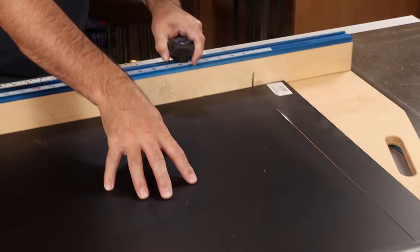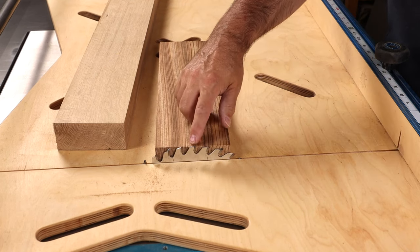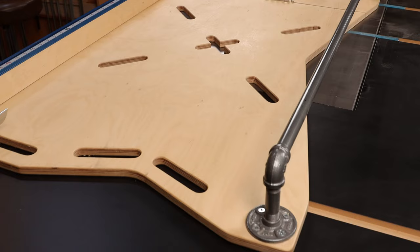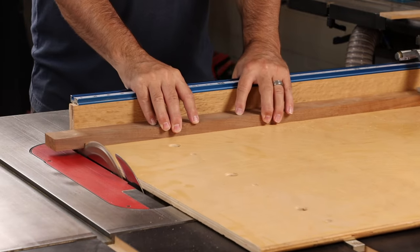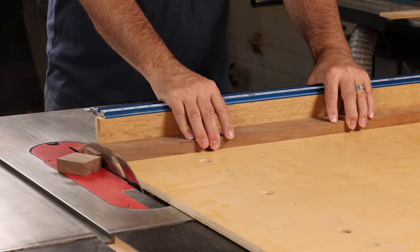There's inherently more stability because you have two tracks running in the parallel slots of your table saw, though I've never had any issues with the single-rail sled either. One key disadvantage of the two-rail sled is that it can't handle thick eight-quarter stock, because raising the blade to maximum height would start to cut into the top track on the front fence. So if you could only have one sled in a new shop, I think the single-rail system has a slight advantage because it can handle any stock thickness. As your shop develops, you may want both sleds at your disposal.